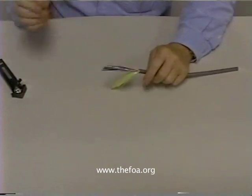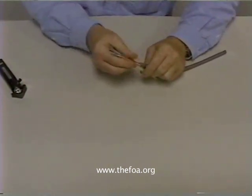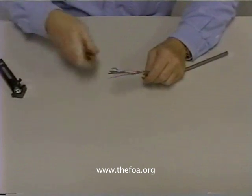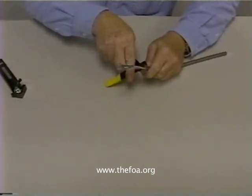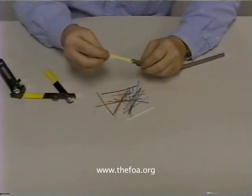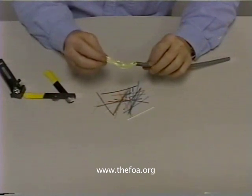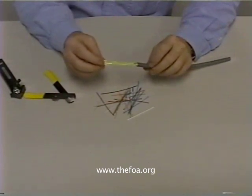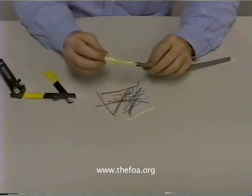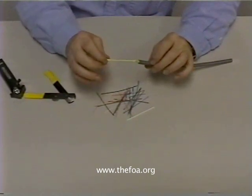When we're pulling this, the method of pulling it is quite simple. What we'll do is we'll cut off everything but the Kevlar. We'll tie our pulling eye to the Kevlar and we'll pull only on that. So make sure that if you're pulling this kind of a cable — and it's very common to pull it in an interduct or conduit — that you only use the Kevlar to attach your pulling eye for pulling.